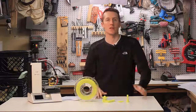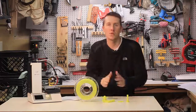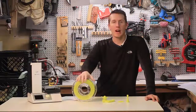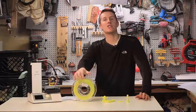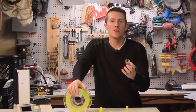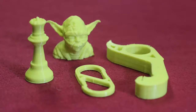The layers still blended in with each other — more than a PLA where you would see distinct layer lines. This just blended smoothly and looked really professional. I printed at 235 degrees Celsius, within their recommended range, and with a heated bed I got no stringiness, no bubbles, nothing. They said it would be a combination of PLA and PETG — the best of all these different worlds — and I really think that's how it turned out. The parts are rigid but strong and smooth.